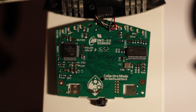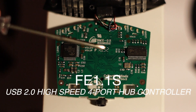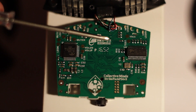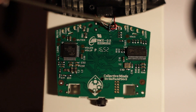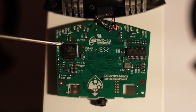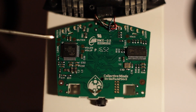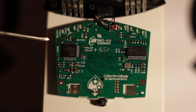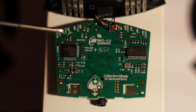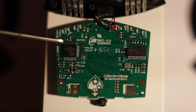On this side we've got a FU1 USB 2 hub — just like I was thinking it would be. It makes sense because the Strike Pack enumerates as a USB device and also needs to enumerate the headset as a separate USB device, so that's where the hub comes in. We also have an HS100B from C-Media — interestingly, a C-Media chip was also used in the Sima Deck teardown I did a while back. These are pretty common low-cost audio chips.